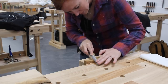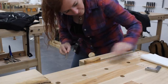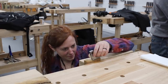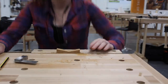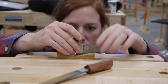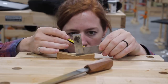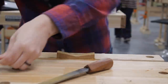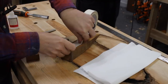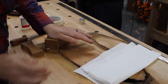Next I spent a good bit of time using a file and getting this one bow tie as perfect as possible, because the plan was to use it as a template for my other two bow ties. I stuck the bow tie in the bench vise, then used a file to flatten each side straight and square, using a small machinist square to check my progress. When held up on the edge I could easily see high spots that I could mark and then remove.